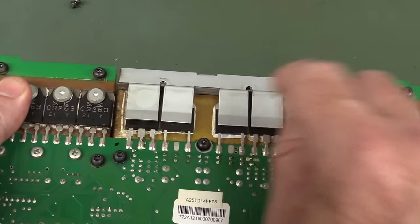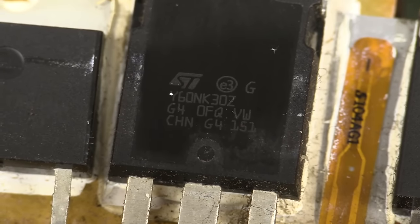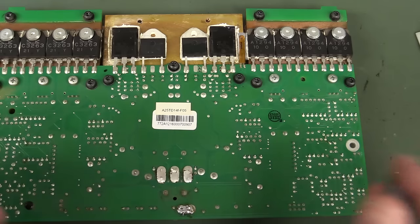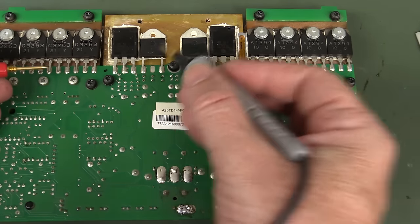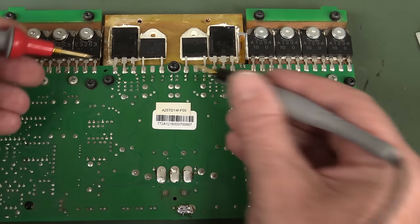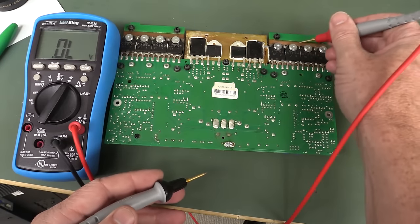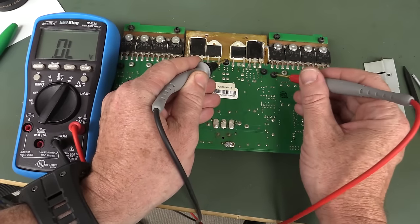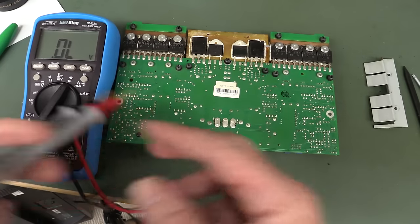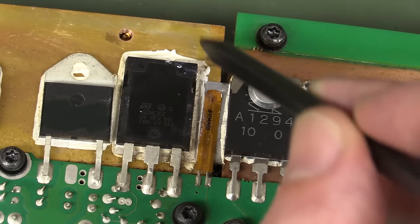Let's have a peek under here. Looks like power MOSFET time - ST Semi 60NK30s. These are super mesh power transistors - now we're talking beauty! There are some big chokes on there going to the output heatsink. These heatsinks aren't actually connected - there's a diode between the heatsink of the output power transistors and the heatsink over here. Some sort of big protection transistor. And there's a little sneaky temperature sensor on that main power transistor heatsink - neat.